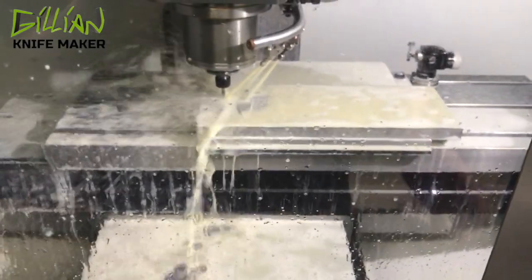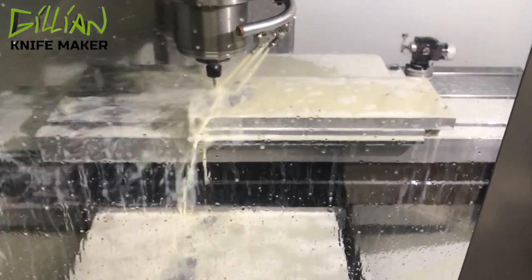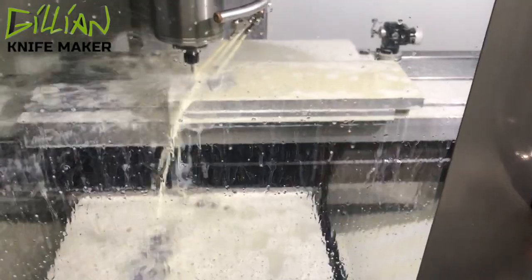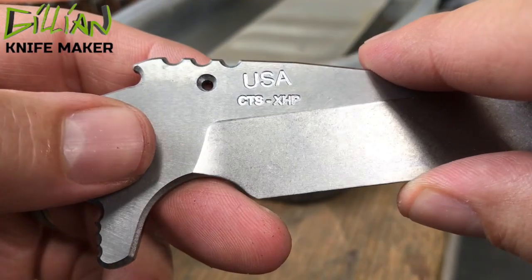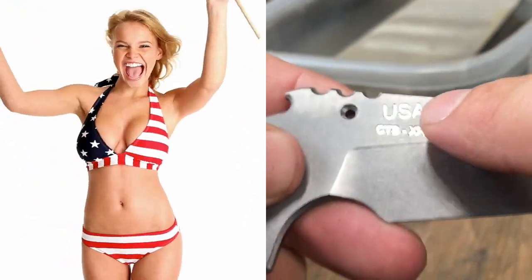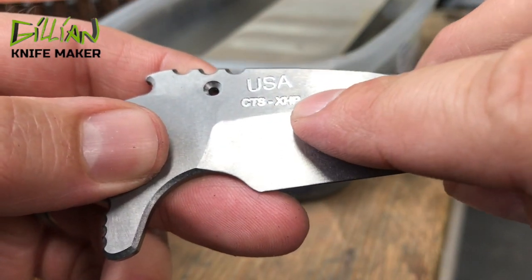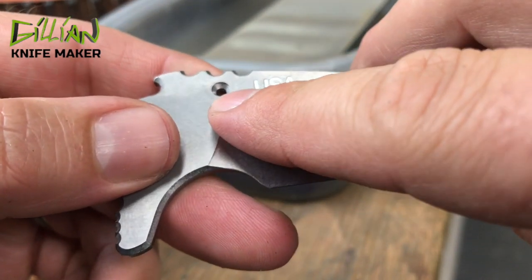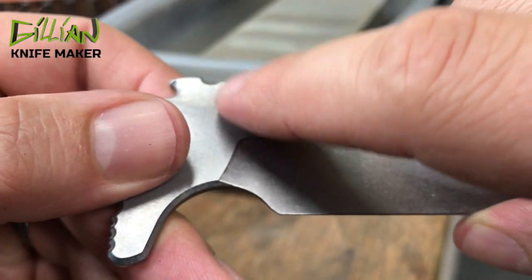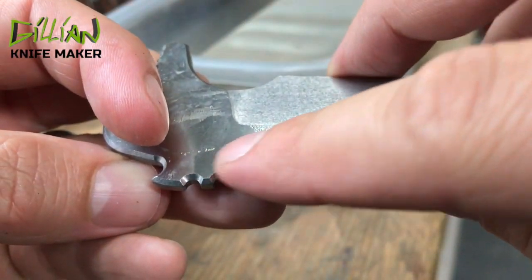What I'm doing here is writing on the blade steel type. After this point in time you don't have to worry about Sharpies — once it's engraved you'll know how to heat treat it. I'm really happy with using Fusion 360 for my engraving. I've engraved USA because I absolutely love this country. I put the blade steel type on there — this is Carpenter Technological Steel's XHP. I also put an 82 degree bevel on the 0.093 pass-through hole so that the 2-56 screw will sit flush. I'm going to lap it and then flip it over and put the maker's mark.